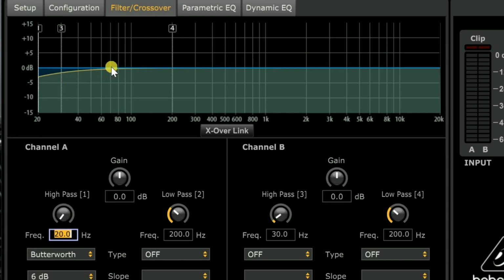Well, we're dropping at 80 hertz. I mean, you look right here at 20 hertz, we're down like 3 dB. We don't want that. That's way too gradual, and you can't see what's happening below 20, unfortunately, whereas on the MiniDSP you can, which I really like. And at 16 hertz, this sub would only be down maybe 5 dB. You're going to kill your sub like this. So we need a much steeper slope for this.